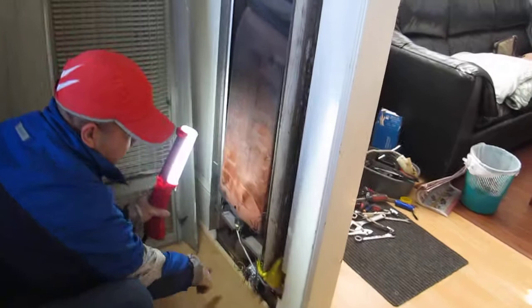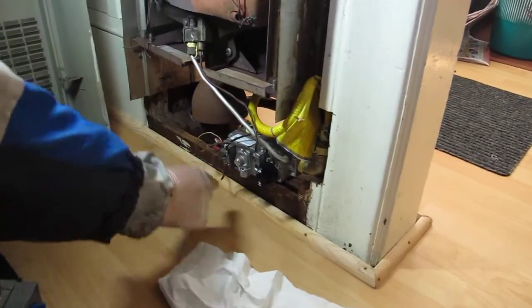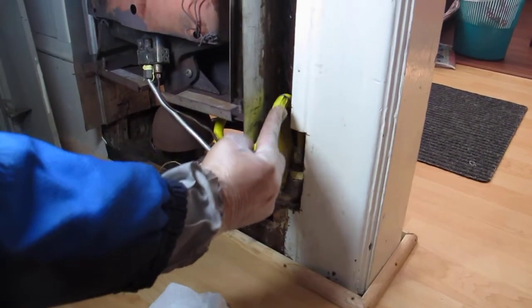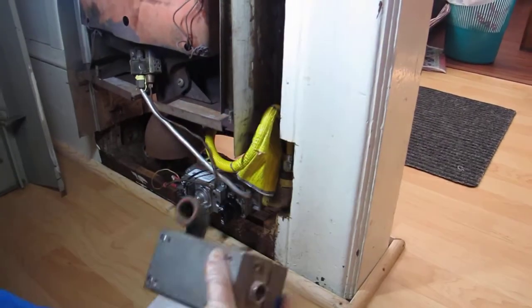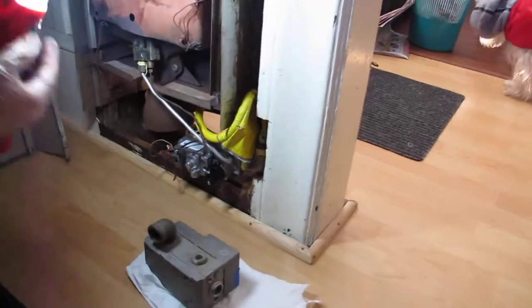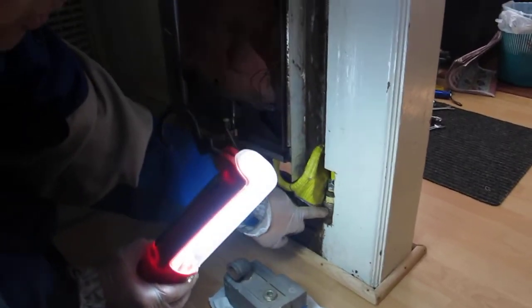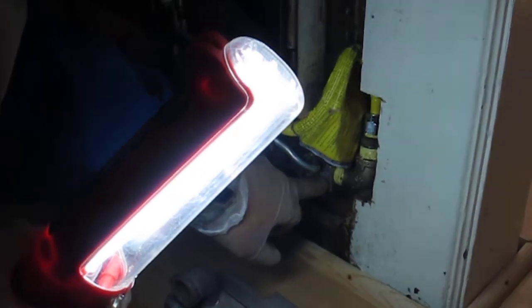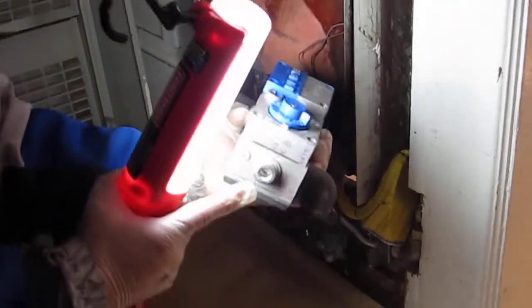we have propane, natural gas, coming from the bottom, and it's coming out of here. Then that propane goes into this yellow line and feeds into this control unit. This is the old one and this is the new one. So you need to get propane into this unit by a port that says "in." So if you get one of these and you open it up, it says "in."